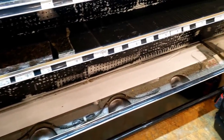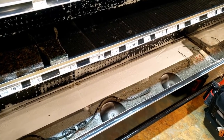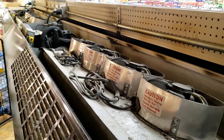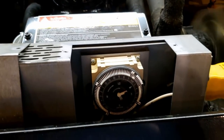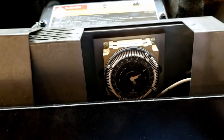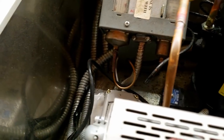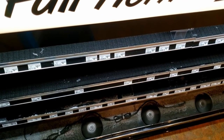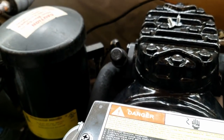We're going to check the defrost clock, put it into defrost, and see what's going on. We checked some of the other condensers — they're running at about 5 defrost, this one's at about 4. Checking the set points, the clock showed negative 6 as my temperature sensor reading; it's set for 28 degrees with a 4-degree differential. Waiting to see if it pumps down — I have a feeling the temperature sensor is bad, but if it is, it should have shut off since negative 6 is a lot lower than 28.